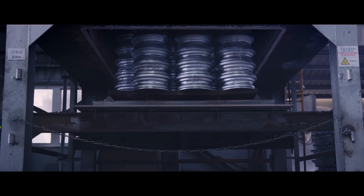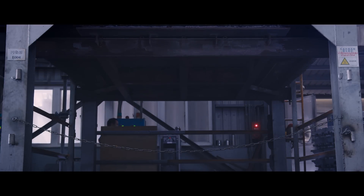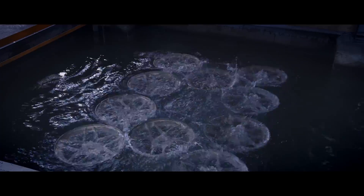The wheels are again quenched to ensure the mechanical properties are maintained and to minimize distortion. The castings are then taken to a heat treat stage. Heat treating is a process that further refines and aligns the aluminum structure, locking in the proper hardness levels by heating up the castings, then quickly quenching them.